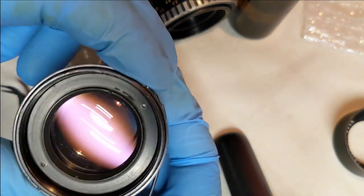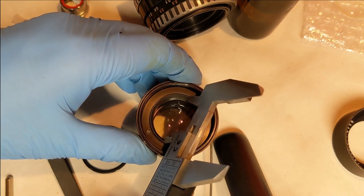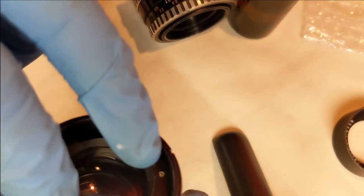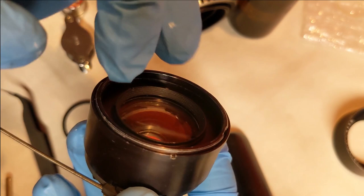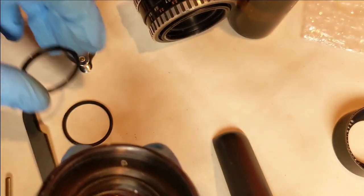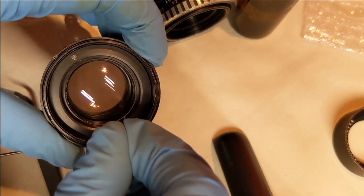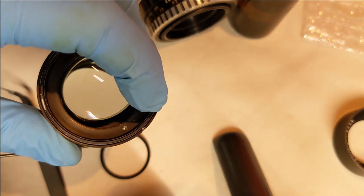This front element is actually in much better condition. I'm wearing rubber gloves because if I do this with bare fingers, condensation and grease from my fingers — no matter how much I wash them — will always find its way onto the lens. With rubber gloves, even if they're a little bit grubby, they're completely fine. I'm paying attention to the quality of parts as I remove them, because sometimes the parts I'm taking off are in better condition than the ones I'm replacing them with, so I'll choose the best parts overall.